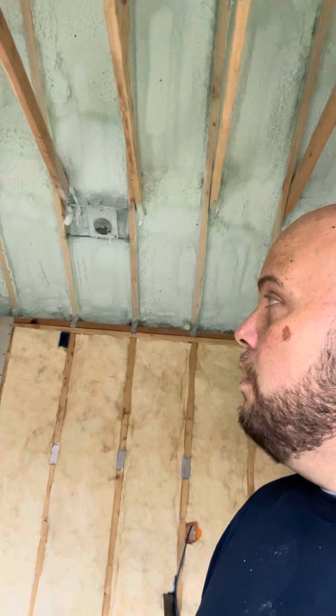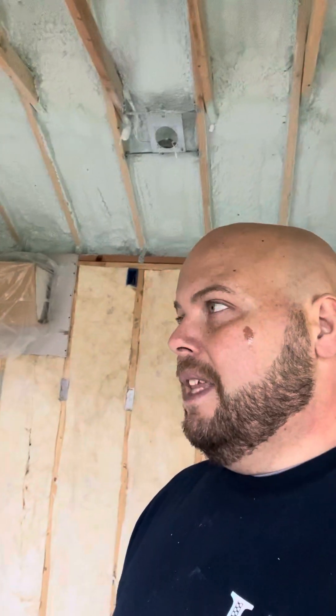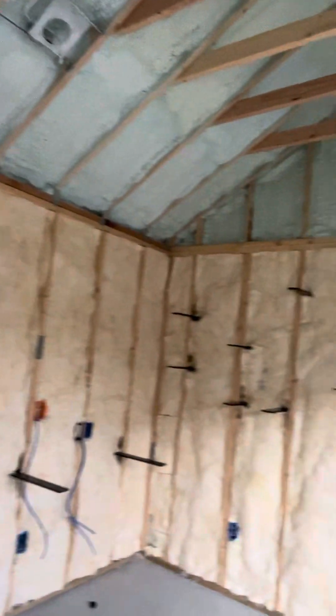This particular customer chose to go with four inches of closed-cell spray foam, which gives a full R-30. You could also do — depending on code requirements and framing layout — two inches of closed-cell spray foam as a full vapor barrier, and then put fiberglass batting on top of that. That's known as flash-and-batt, and that's a great system. Combined with fiberglass batts on the walls, this will be a comfortable and efficient building to get some work done in.